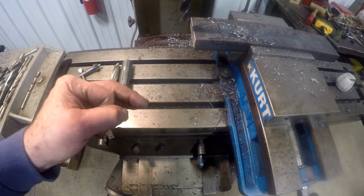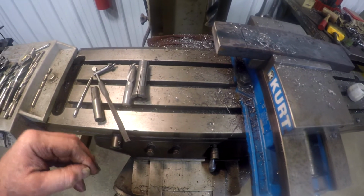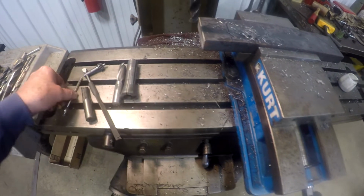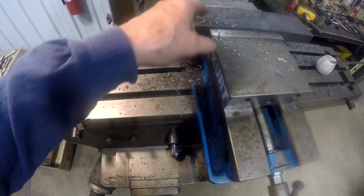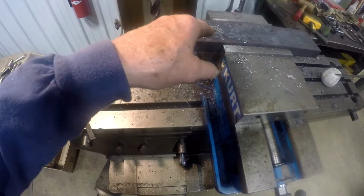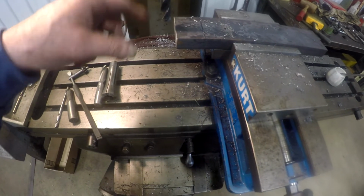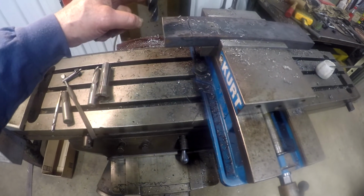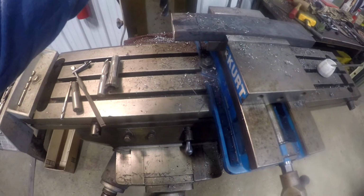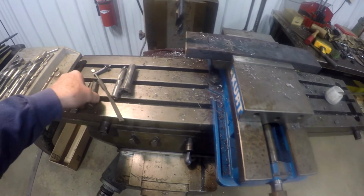Pin that's on the top of the axle, pin that's on the bottom of these leaf springs. So what I'm doing is starting out with a 1/4 inch pilot bit, drilling down. The hole has to be a 1/2 inch deep. I'm drilling down 1/2 inch with the pilot bit, then following it up with an 11/16 drill bit.